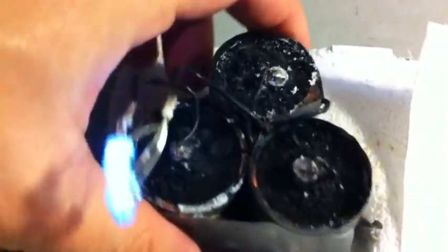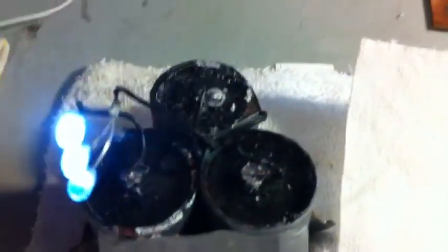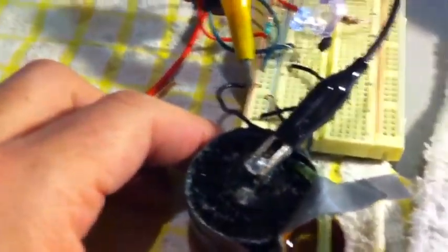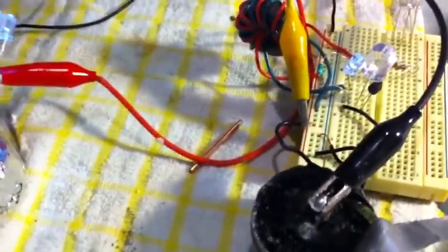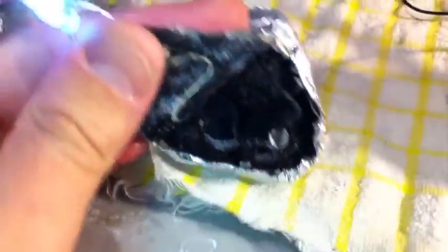About the cells, I did number 18, so I built a new one, also exposed, so I can continue measuring its performance. The one I showed previously with the water running is an oscillator, running pretty well. I've been measuring the voltage and current — it goes down, then I add water and it goes up. With alum, that cell runs about 13 milliamps; this one is between five and eight milliamps.